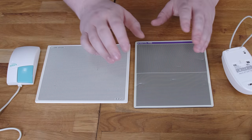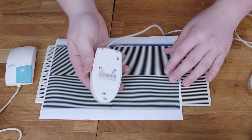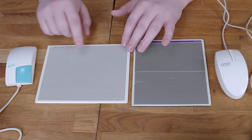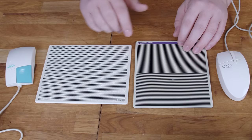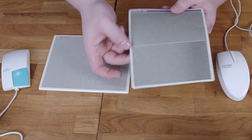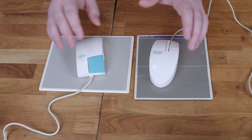Something I forgot to mention in my previous video is that while this pad can't be made any taller, it could be made wider — this, for instance, is a perfectly valid pad for the Q500. The LMOX, on the other hand, while it still requires a custom mouse pad, doesn't have these two separate regions. It has a grid pattern where the X and Y info are distributed evenly across the whole thing. This one's a little bigger than the Q500, but you could certainly enlarge it with no sweat. The LMOX pad is also rigid plastic, while the Q500 has a conventional neoprene base, which is really easy to crease. The LMOX pad is also very off-white — like beiger than you'd expect. Here's some normal white paper — you can see it's very beige.